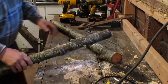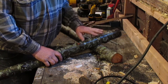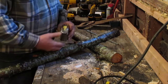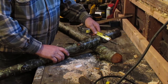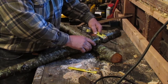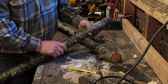This time we're going to use a little smaller set of logs and we're going to join them together and see if we can get them so they don't move at all, or if they do, very little when it comes to racking. One of the things you're going to need is something to measure with. I'm going to use my tape measure and it looks like I've got a maximum of a two inch wide log here, so I'm going to go with inch and a half. This is going to require that I cut an inch and a half this way and this way. This takes a lot of care because you're going to need to cut the sides and the bottom on the other logs so that everything fits snugly.